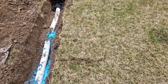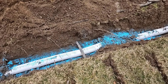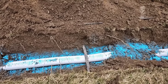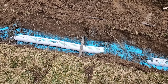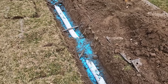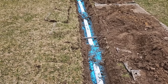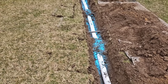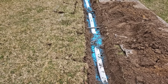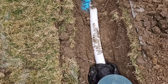We had to go under this one sprinkler line. Unfortunately, sometimes you're forced to make the hard decision: do I go over it or do I go under it? The guys had to go under it to maintain their slope, and they had to go a little deeper than they would have really wanted. The nice thing is the 3-inch pipe allowed them to go under it — they didn't have to cut that sprinkler line. That's a huge advantage when you're not cutting up somebody's sprinkler system.